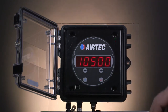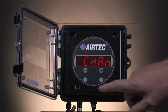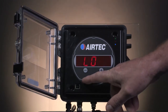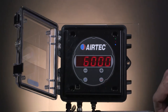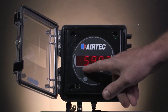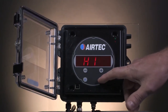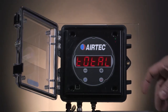To calibrate the low for channel 1, press the P button for 3 seconds. Chan will come up. Press the P button again. We're doing channel 1, which is the front axle group. Keep pressing the P button until you get to low. Press P once more — there will be a value there. We need to match this up to the value of the weighbridge, which is 5,920. Once that matches the same as your weighbridge value, store the value by pressing the red arrow button. Once stored, press the silver button at the side to exit the program mode.